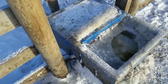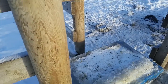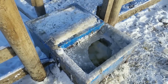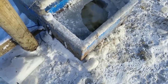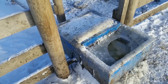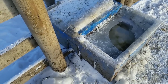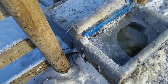Sorry for the wind — it's being crazy. This waterer is not working right now. I have an electrical issue with it inside. What happened was there should have been a board here with a cross too, and that has to be done before the cows come home. A little heifer jumped and put her foot right in there, bent the bottom — it's just 10-gauge metal in there — and she bent it and kind of damaged the heating pads underneath. So right now I just have two 75-watt bulbs in there.